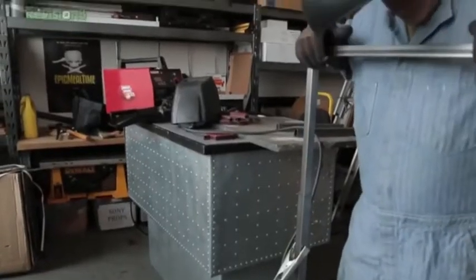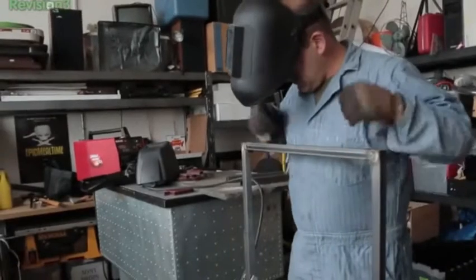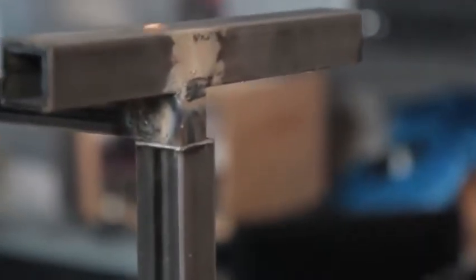So once we finished that upper U, we dropped that into each of the two legs and then mounted the two legs on our H base and started welding. And then once that was done, we attached some horizontal pieces to act as our tabletop holders. Well, first we jumped up and down on it. You did pull-ups on it. I held my weight on it, so we decided it wasn't going to fall over.